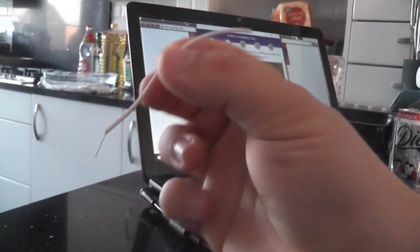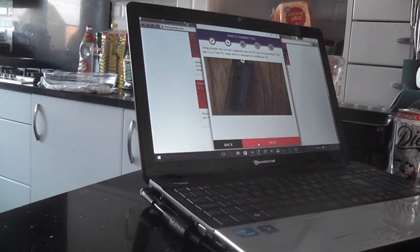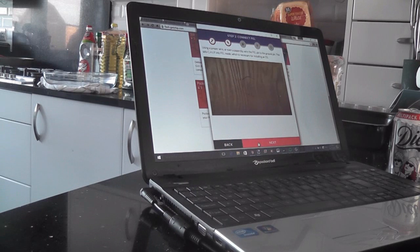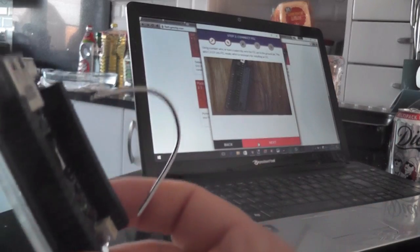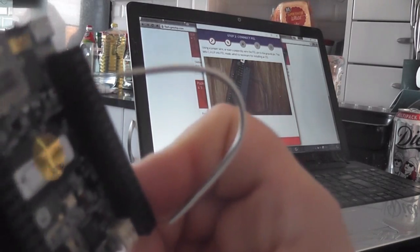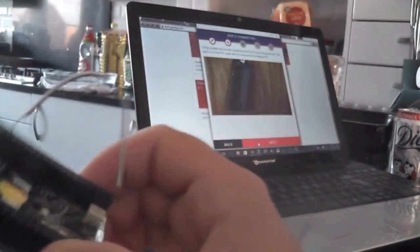I've used a small piece of speaker wire — you need a piece of wire about this big. It will tell you that you need to wire the FL pin to the ground pin, which can be found on the side of the CHIP. You're looking for the FL pin and the ground pin: the ground pin is right at the bottom when you're holding the device USB-side up, and the FL pin is the third pin down from the top.